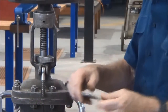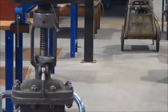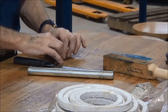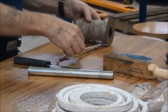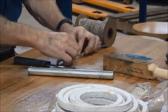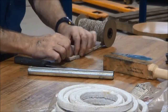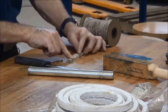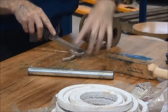What we are doing here is taking the diameter of the stem of the valve to know what packing to use. If we take that diameter and subtract it from the diameter of the throat of the stuffing box, then divide by two, that will tell us what section of gland packing to use. Another method is if the gland packing you have removed is the correct packing that has been used for the job, you can use that as a guide.